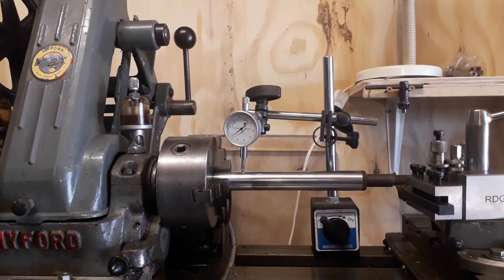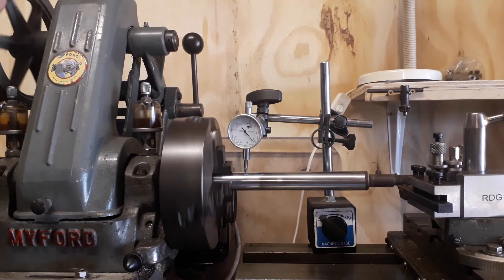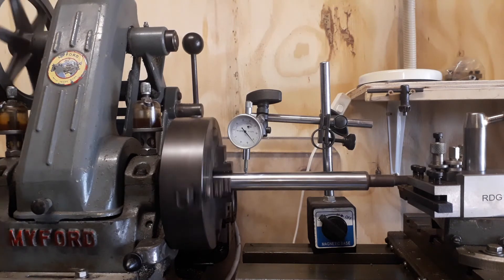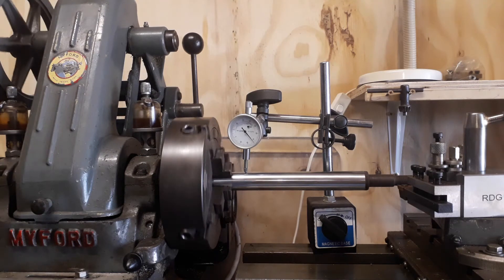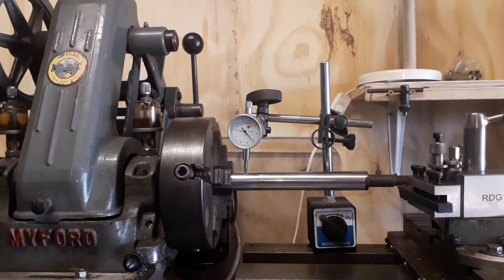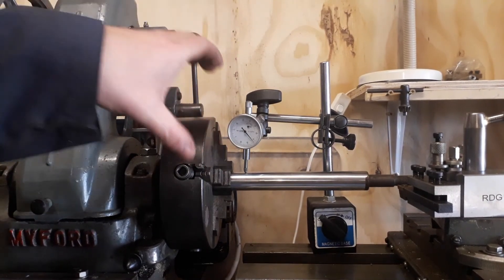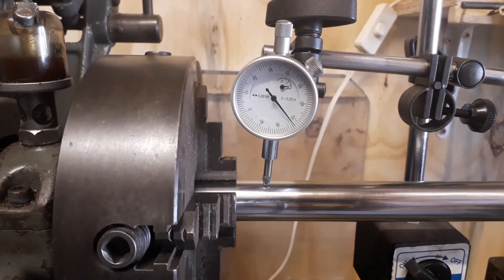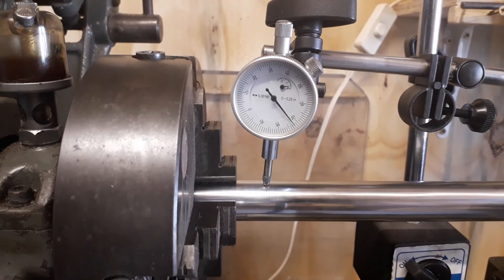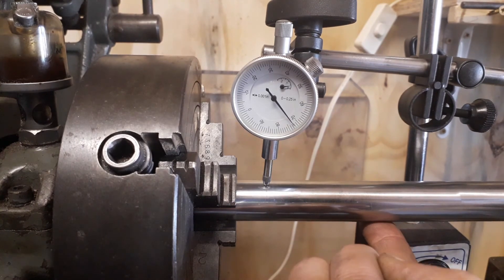It's taken me just a couple of minutes to set the four-jaw up. This is where the DTI is all important. As you can see, it's basically taken me about a minute and I'm getting probably a tenth of a thou runout on that. If you want to be more accurate than that, you can certainly get much more accurate. The idea with the independent is you can push it around, move the bar until it is truly central — truly true on the lathe. This close-up shows the dial test indicator on the four-jaw independent. You can see everything moving there, and just to prove it is actually touching the bar, you can see it just moves slightly as I flex it.